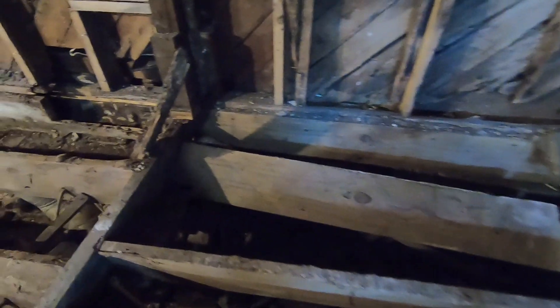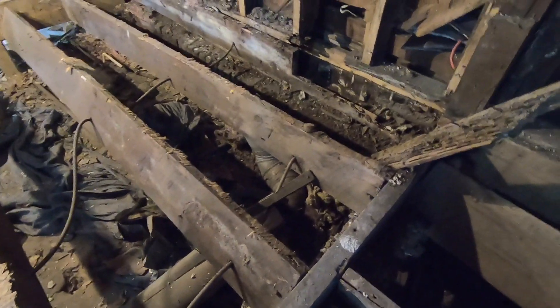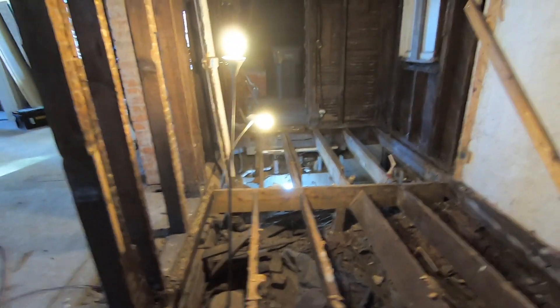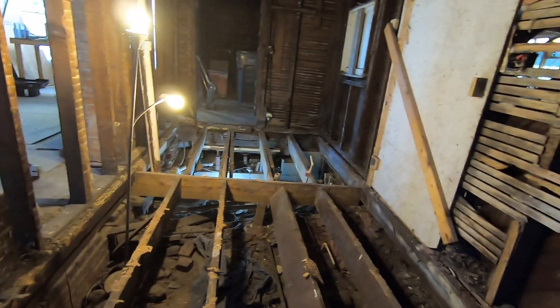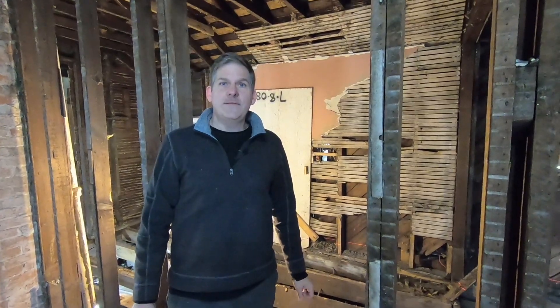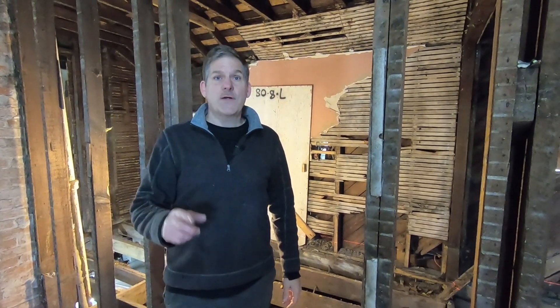My son, when he took these floors off, you can see how these joists are all twisted. They weren't even tacked in well — some of these have a nail, maybe two nails toenailed in, just very poorly supported. As you look that way, you can see how it's tilting away from the house and tilting down. The goal is to get this flooring the same as the flooring that we've already done. That's the update we have so far. Thanks for watching — please subscribe, we've got lots more videos coming. See you next time.